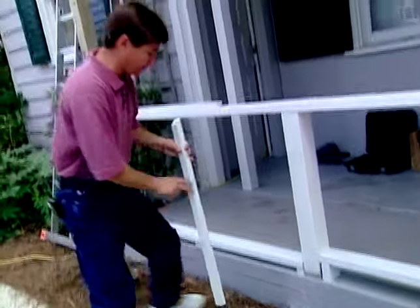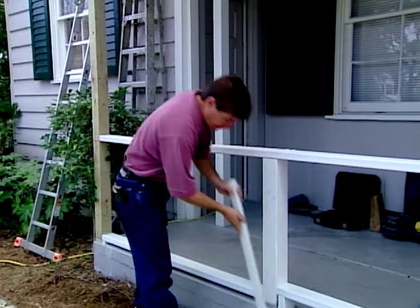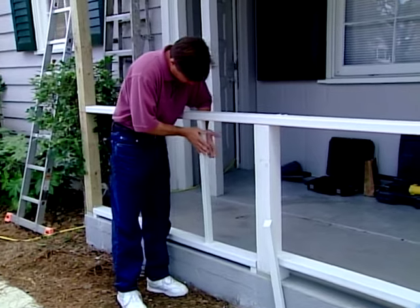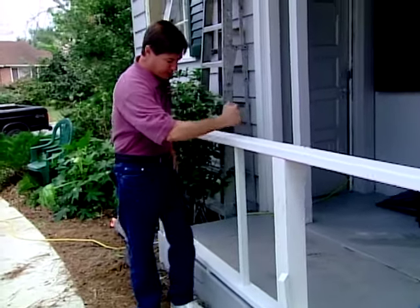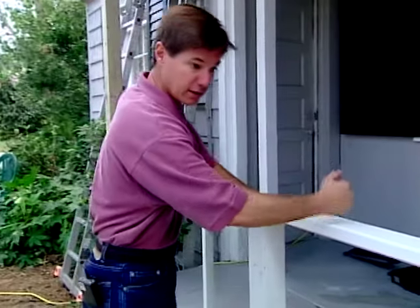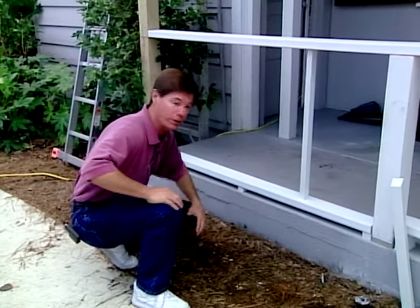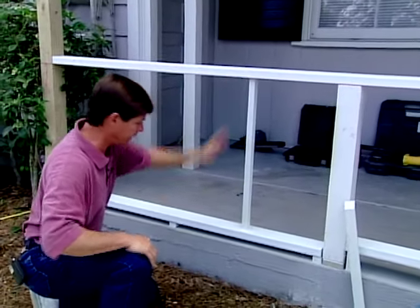Then what about our hand railing? Should it come up at an angle and stay outside? Or can we use a piece to come inside, put in here, whether it was moved out to the edge or placed right in the center? That way, this will add support wherever we put a spindle down here. And that'll really help because this needs a little more structural support. So that's kind of what we're thinking. Lower here for water, air, and trash, be able to sweep off the porch, and then put in these spindles in the middle. That's our game plan.